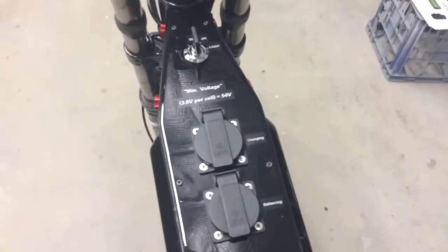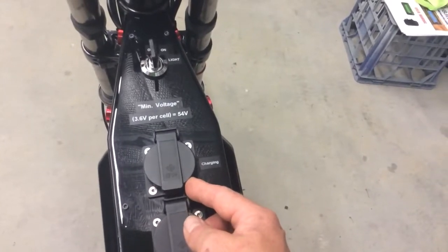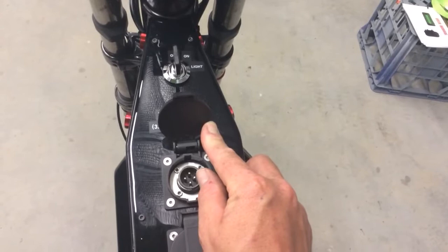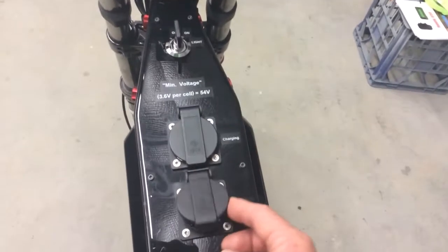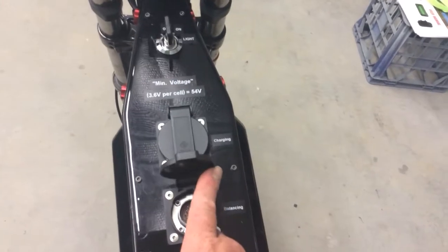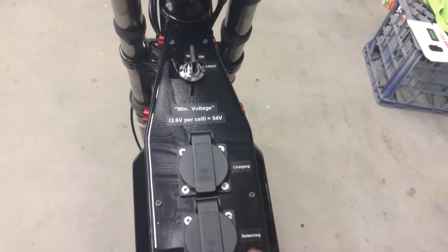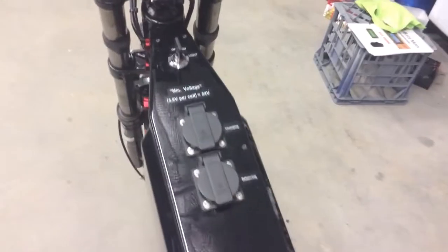Going back to the battery — it's two separate batteries: an 8S and a 7S, 10P. The charging port is four pins, so it does battery one (8S) and battery two (7S). While that's charging, you're balancing it — so that's 8S balancing and 7S. They're off the isolator, so once you turn it off it isolates each battery separately.